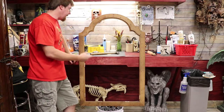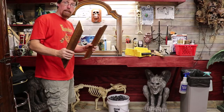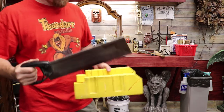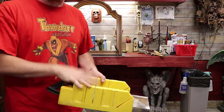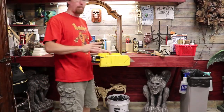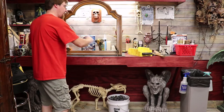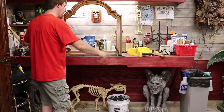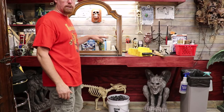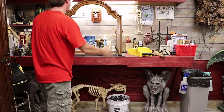When we come back, we're going to have this bottom piece ready to get screwed onto the top piece. So we're back — I went ahead and cut the excess off. All I used was a simple miter box and saw. I think you get this set at Menards or most Home Depots for about $10. Nothing fancy. No compound miter saws, no power tools. Just simple hand tools. We cut this frame down where I wanted it. I marked it on the back, used this piece to mark my angles. I went ahead and got it glued. I put some screw holes in the bottom. The glue will hold this thing together stronger than the screws were, but I'm just going to throw the screws in anyway. We're a lot shorter now, so I think that's pretty cool.